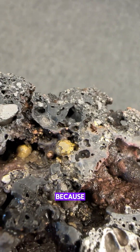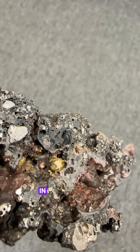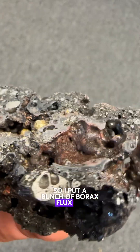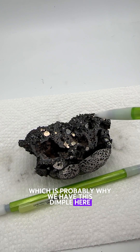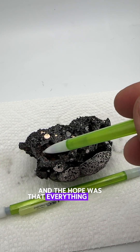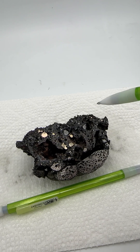That's not a great thing because we want everything to become homogeneous in the puddle at the bottom. I did try to flux this thermite — I put a bunch of borax flux on the very bottom, which is probably why we have this dimple here, and then I put borax flux around the top. The hope was that everything would get hot enough to liquefy and completely mix in the bottom.